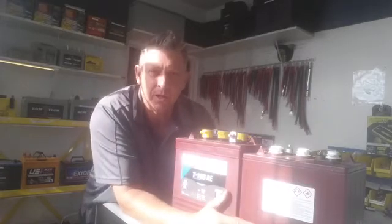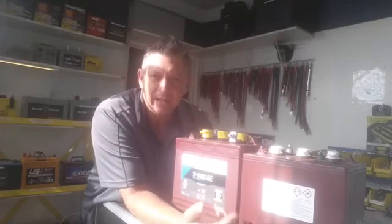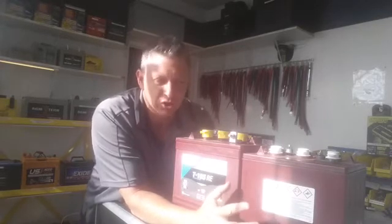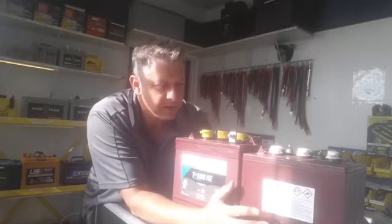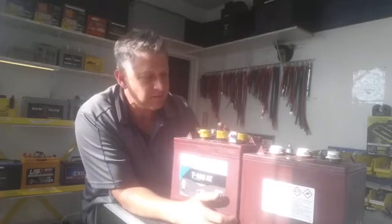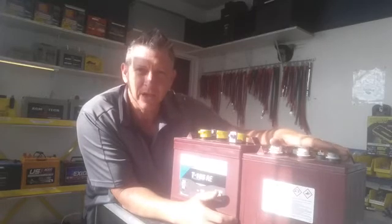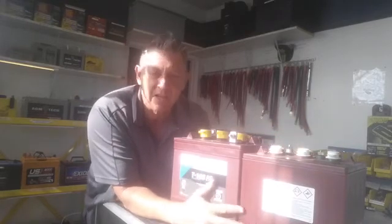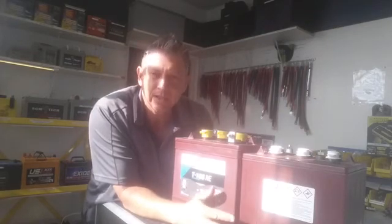The AlphaPaste is also a proprietary technology that Trojan uses — it's a very high density active material on the plate that allows high conductivity. They also use a thick grid structure on their plates that is superior to the Costco Battery. If you have a solar application, I do recommend the T105RE. If you have a general purpose use — whether it be a golf cart, scissor lift, or even a marine application; we put a lot of these into boats for house power — then the regular T105 is going to be your best bet. This is made in the United States, here in California and also in Georgia. Trojan has been doing this since the 1920s and I really like their products — very tough.